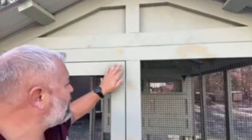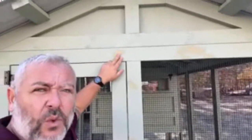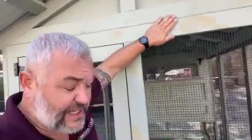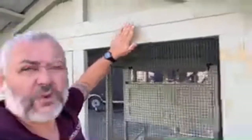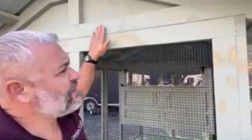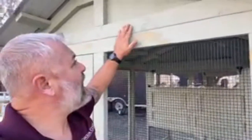The disadvantage of solid acrylic stain is it really soaks in and amplifies defects in the wood. You can see all these knots right here - they don't look good. If you really want it to look pretty, we love a wood filler. The wood filler we use actually has pieces of wood in it - it dries really hard. You apply it with a knife, wipe it off, hit it with a sander, it levels the surface, then you stain or paint right over it.